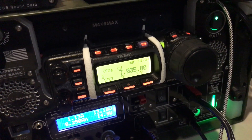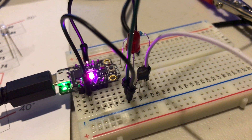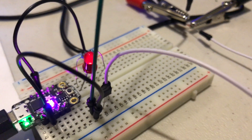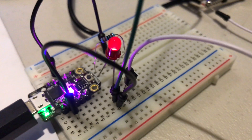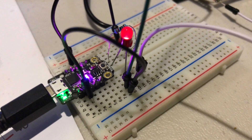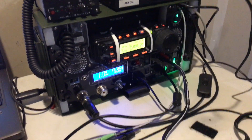What the Arduino is doing is translating a beacon signal I programmed into the board. I have this LED in series — I wasn't sure if the LED would drain too much — and I think that's about a 430 ohm resistor. But it all seems to work as I had originally planned, so that's the proof of concept. Now I just have to put it all on a semi-permanent board and then I can have a plug-in beacon.